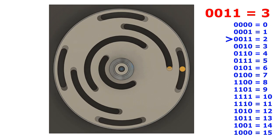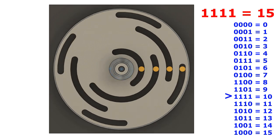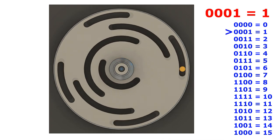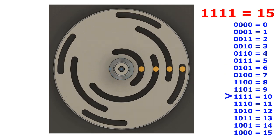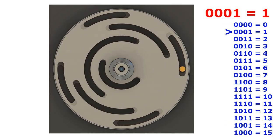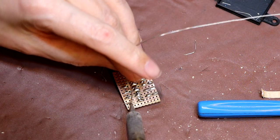And there are several non-binary codes which we can use to achieve this. The coding system that I'm using is known as reflected binary, and it was invented by Frank Gray of Bell Labs in 1953. And you can see as our Gray code wheel rotates that we only ever get 1 bit transition at a time. Now at first glance the output from our Gray code encoder doesn't appear to be logical in that it produces almost what looks like a random pattern of bit changes. And each bit pattern is unique for the wheel's position, but we do have to decode it to produce more logical numbers.